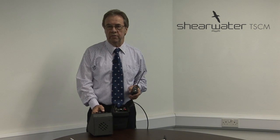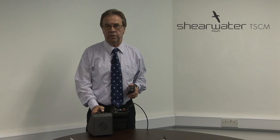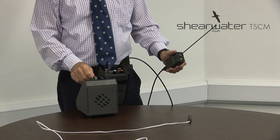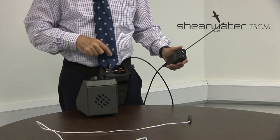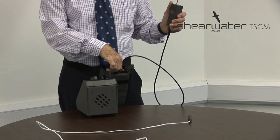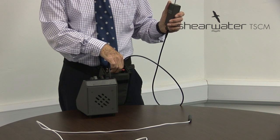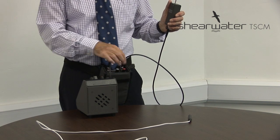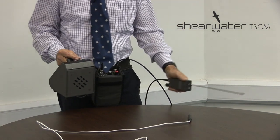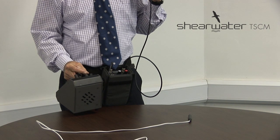If stages one and two have not revealed an attack, it's time to move to stage three. Stage three is an overt method and the attacker will know what you're doing. The format for stage three is probe to filter, filter to power amplifier. We now adjust the filter — which you should do every 30 minutes because, believe it or not, the mains frequency drifts. Optimise the filter, turn the power amplifier up to maximum, and the microphone is readily revealed.